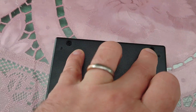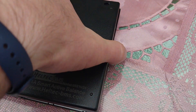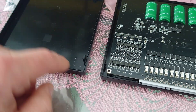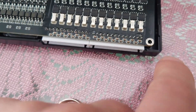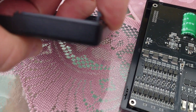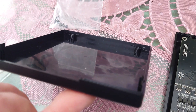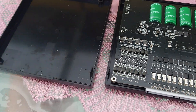First of all, you have to open the two screws up there — take those out. I have those here already completely dismantled. Then you can open the case. It's quite important to know where the noses sit — they sit exactly here and here, and they are snapped into these hooks. I used a plastic card to press a little bit against here to get it open. If you try this really gently, you will have those fully intact and you can snap it back together in one piece.